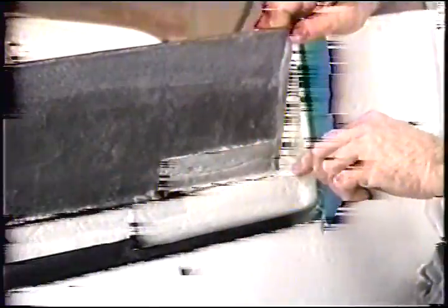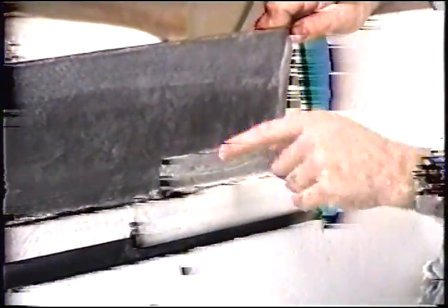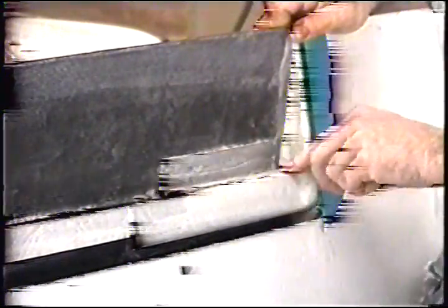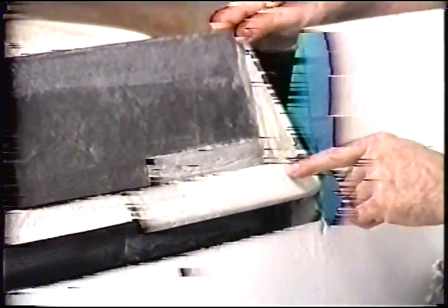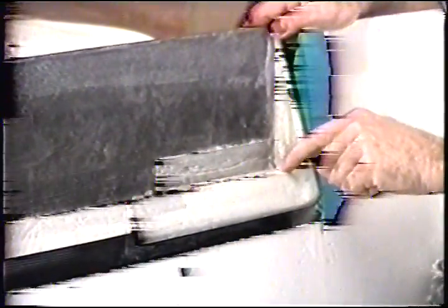You'll clean up the tube first, bond it in place, pop rivet it, a small amount of flox in each corner, 1-ply glass over the tube, and then finish up with all your pop rivets. The T-taping here, when we did this T-tape, we filled between the tube and the T-tape with micro. The glass over the surfaces and the micro makes this particular load transition point bulletproof.